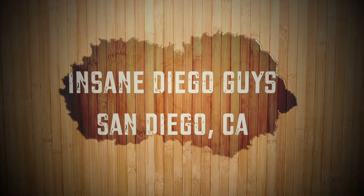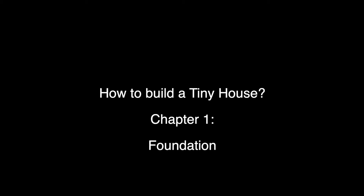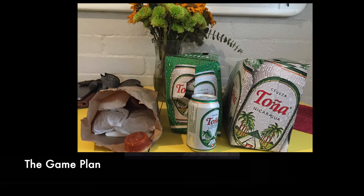This video is brought to you by... We just bought a bunch of wood and filled our bellies with beer and burritos, so I guess we have to start. We're just gonna put down a subfloor layer, paint it with Old Henry's to get it waterproof, screw it right to the frame, and then we can start building on top of that.